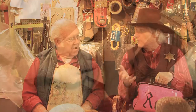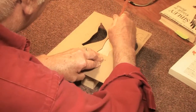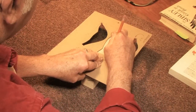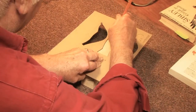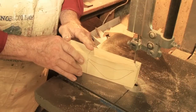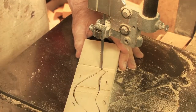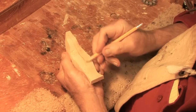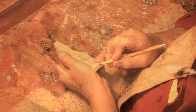I draw on the block. I have to take my pattern and put it on the wood, then I have to cut it out on the bandsaw. So you have patterns? Oh yes. Where do you get your patterns? I make them myself. And then I have to go to the saw and cut out the basic shape to maintain the profile of the bird. I draw a centerline at the top and bottom of the block, and as I'm carving I never take that line off — that maintains the profile of the bird.